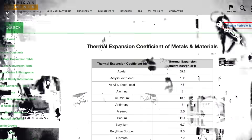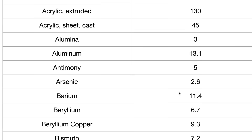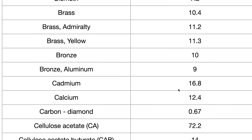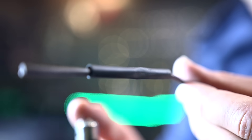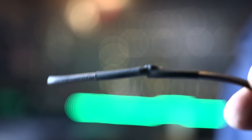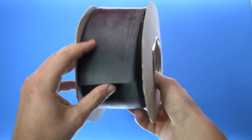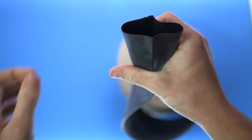So I started looking into materials that controllably change size. It's well known that most materials expand with heat, but looking at the thermal expansion chart most materials don't expand more than about one percent, whereas ideally we'd like a change of a few hundred percent. What we really need is a material that shrinks with heat — something like heat shrink, used to insulate wires. Just add heat and it shrinks down to fit what's inside, shrinking to a half or even a third of its original size. This is what happens when you let a YouTuber shop online — two-inch low-temperature heat shrink.